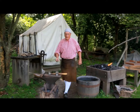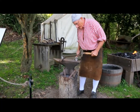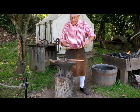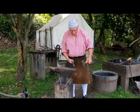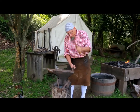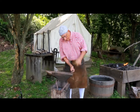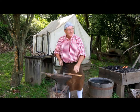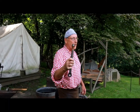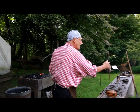Now this is red again. I'm cutting almost all the way through — not quite. I put it into the header, break it off the rest of the way, and then hammer the head. The last four strokes give it a design. Blacksmiths wanted to make things that were aesthetically pleasing. This is called a four-clout nail — it has facets on it like a diamond.